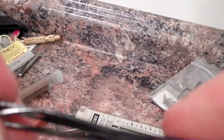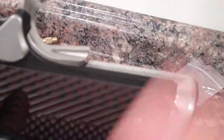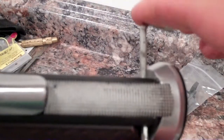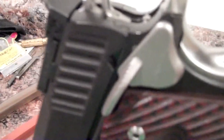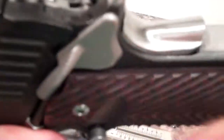I'll reinstall it and then we'll measure the trigger pull. I installed it — one thing I do is loosely or temporarily install a lot of things just to test it. So what I did is I just took an Allen wrench, put it in place — easier to pull out than the pin. This gun actually had an ambidextrous safety, and I just used one of my other safeties that I have laying around, because that's much easier to put in and to check function with, and then take out. Once it's all set, then you can finish putting it back together completely.